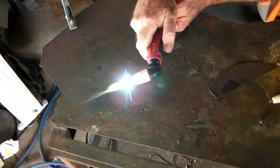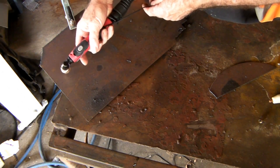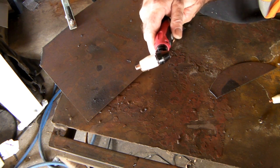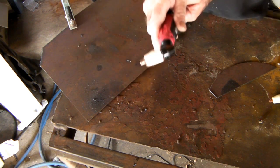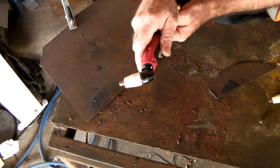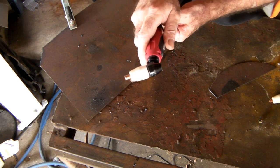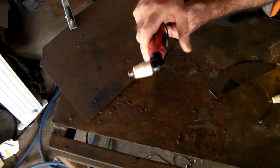See, when you push the button, the flame automatically shoots out. You don't have to touch it on the steel for it to get it to work. The Pilot Arc is better if you're cutting rusty steel and that sort of stuff, or steel with paint on it. Basically the difference between a Pilot Arc and a non-Pilot Arc — this is now a Pilot Arc torch. When you push the button, the flame flies out of the top without you having to touch anything else.